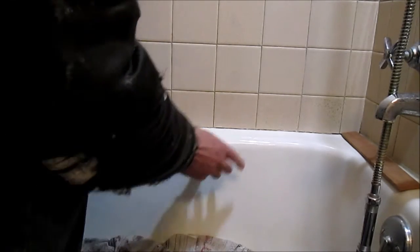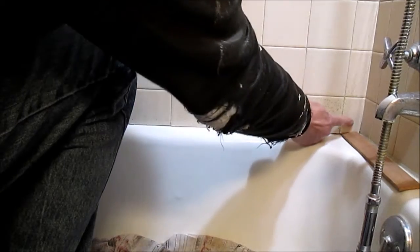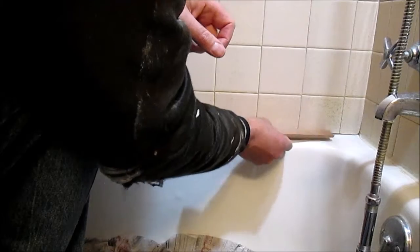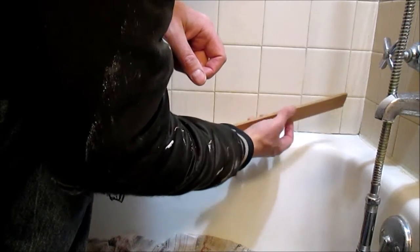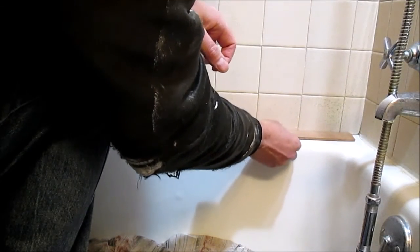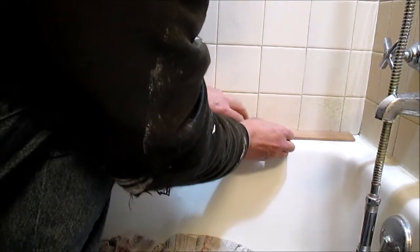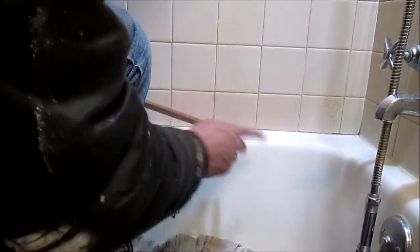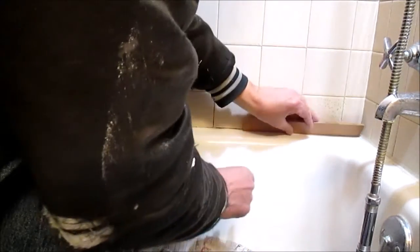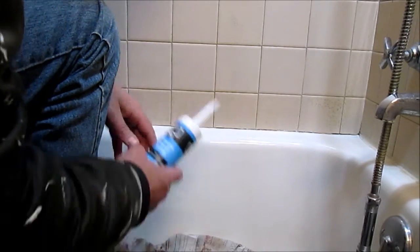What I generally do is take some painter's tape and run a strip on the wall or the tile. I like to put that up a quarter of an inch, and I like to use a quarter inch thick piece of wood as a measuring device, because it's hard to measure with a ruler. I would put that in the corner and start the tape, then move this down the other end, put it up against the wall, and start a piece of tape on the tub itself. So you have a quarter inch on the tub and a quarter inch on the tile. But I am out of the tape, so